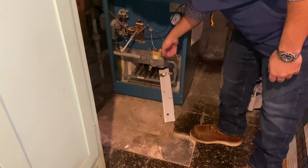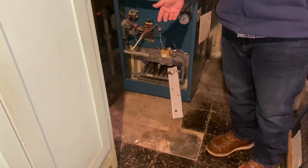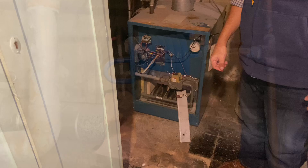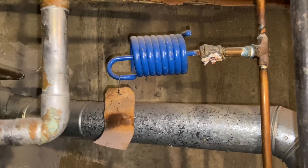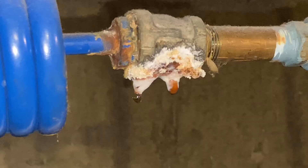This is brand new — so what's the problem? Still won't light. I can't even get gas to it. You sure the gas valve is on? Yeah. See that — that's pretty bad. There's a leak, it's dripping on top of your water heater.